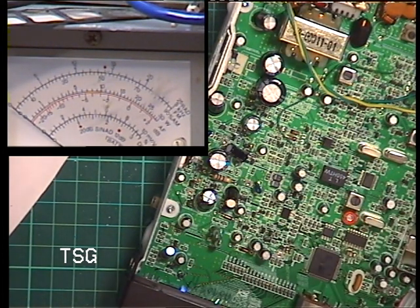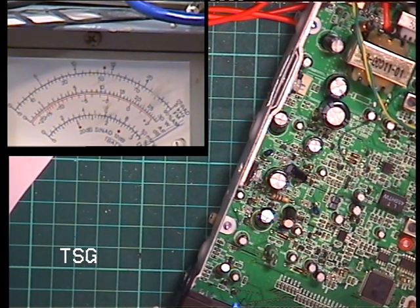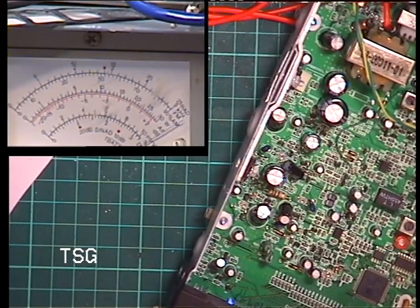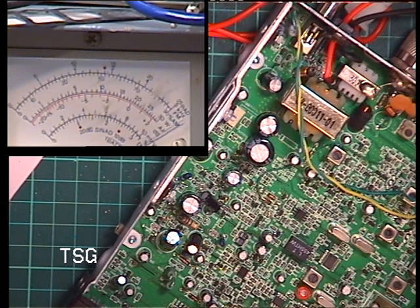I'm just going to check one thing while I'm in AM mode. So I'll just pause the video. Well, that sounds pretty awful on AM. I've just found in the past that L106 was easy to set in AM without a circuit in front of me. Perhaps it's part of the AM, I don't know, but it's kind of, what's this kind of moaning and clicking, and sounds awful. Anyway, I'm going to get this program back onto UK, and we'll carry on with the receive part of the video.